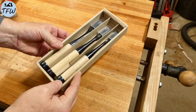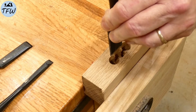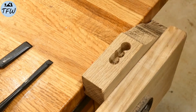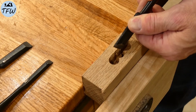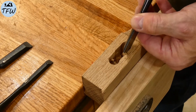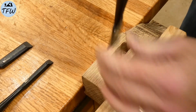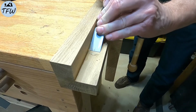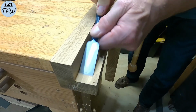Finally, a little more expensive is this beautiful set of Japanese wood chisels. And they come with a metal ring so that you can use a hammer. They're nice and sharp, although you will have to sharpen them a little bit. They really do a great job with precision trim work, like you're seeing here on this piece of white oak. Now this is the most expensive gift set out of everything we featured in the video at about $47. And you can get this from Amazon.com, and a link will be in the description of the video. But for cleanup work, cleaning out glue on the inside edges of glued material, this chisel set is great.